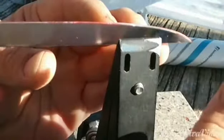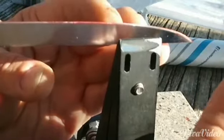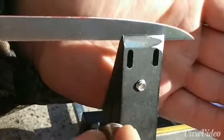We're still at the 20-degree mark. Take a couple swipes — you want to use your fine stones until you find where the bevel is actually at. Since moving back the blade, you can see that it's going halfway up the bevel, and that's perfectly acceptable.